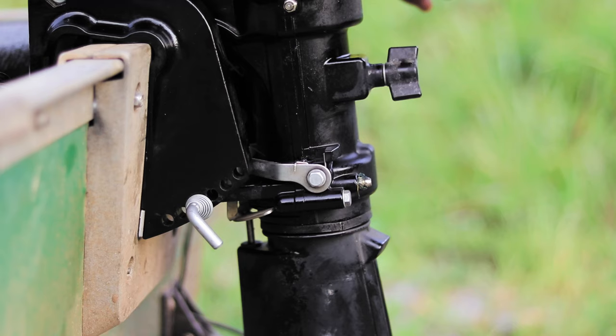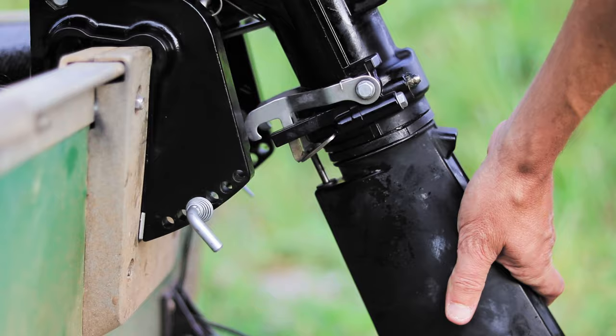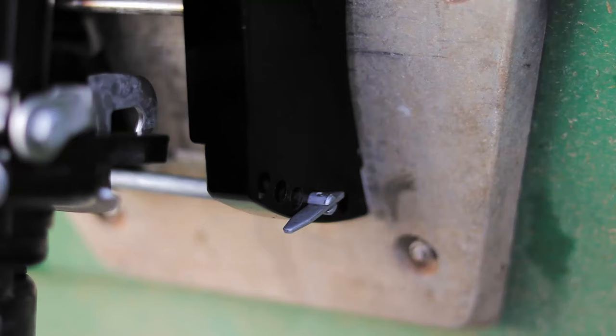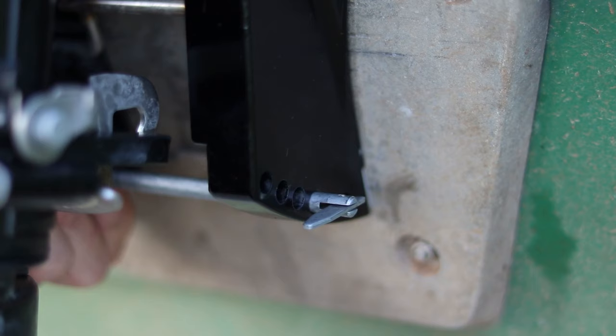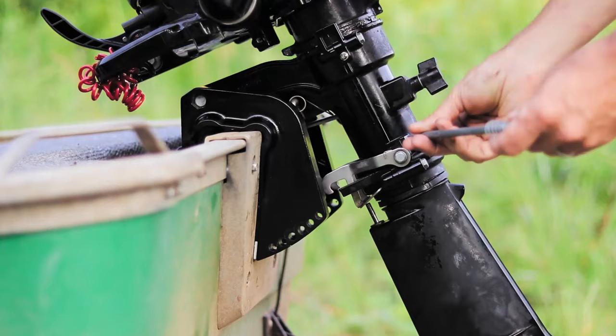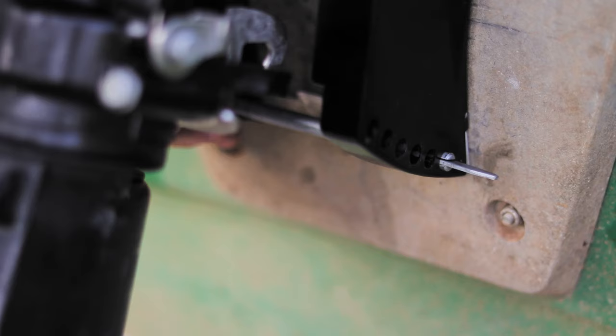In shallow drive position we're in forward, so the trim is not locking on the thrust rod. Simply lift up until you hear a click and now the motor is not going to fall down. At that point you're safe to move the thrust rod. There's a retaining clip — push from the other side where the spring is, flip it open, and it'll pop right out. To reinstall, press the spring from the other side, flatten the clip, and it'll lock in place.